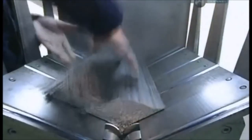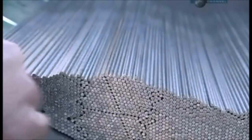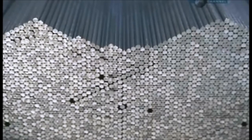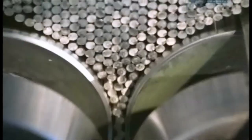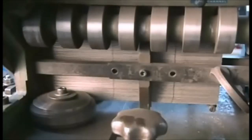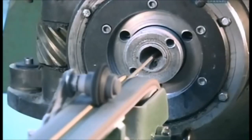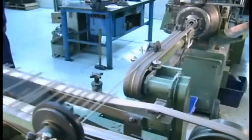To load them into the press, the wires are first stacked in a feeder. The opening at the bottom can be adjusted because core wires have a range of different diameters. These rollers pass them through the press one at a time. Four wheels then pull the wires from the feeder into the extrusion press for coating at a rate of up to a thousand electrodes every minute.